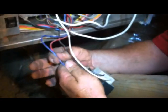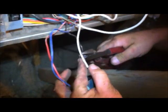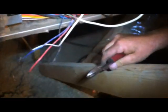So if we want this to run off 240 volts we use the white and the orange; if we want it to run off 120 we use the white and black. All these wires are already cut and trimmed, so there's no reason to unplug the old one from the circuit board. We're just going to take our wire cutters, cut those wires, get the old burned-out transformer out of the way, and strip the wires back about a half inch.